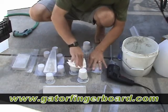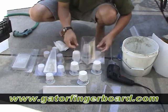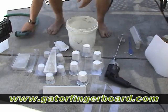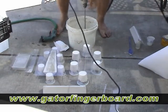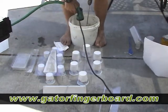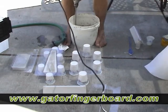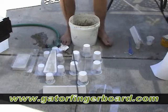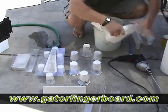So there's our mold — get some paper cups to put underneath the little flaps and set your mold down. Get your cement — I just poured some cement in here — then add some water. Get your drill with a mixer attachment. Stick it in there and mix it. You want it kind of easy to pour — a little soupy is fine, that's actually pretty good.